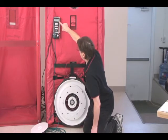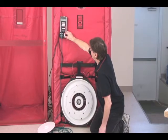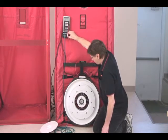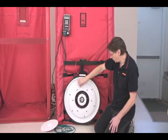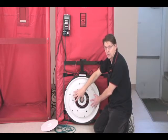If this pressure goes up, then obviously the air going through the fan is going to be greater. As we turn the fan up, we see that this negative pressure becomes even greater. So the really easy principle to understand about door fan operation is: the harder we suck on the hole, the more air that goes through the hole.